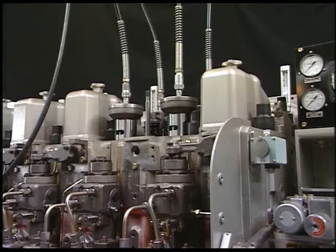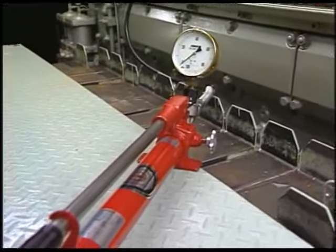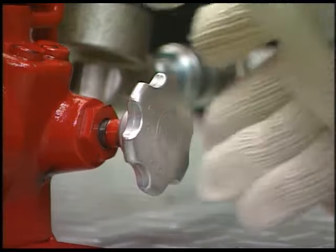In applying the hydraulic pressure on, check again each attaching portion of hydraulic hose beforehand, and finally, close the relief valve of hydraulic pump tightly.